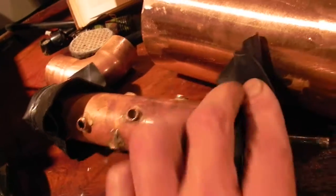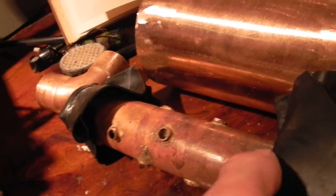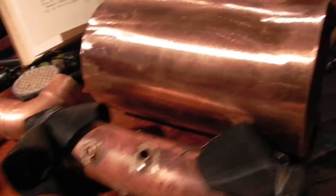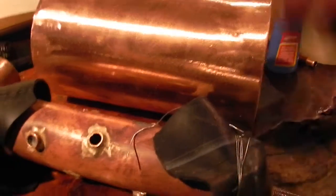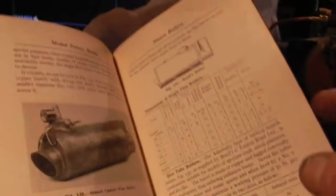I checked for bubbles around my silver-soldered joints. This is 55 easy flow, so it's quite strong and quite hard to braze on there. But I got it all done, checked it for leaks, had to go back and fix a couple of pinholes. Now we'll take it to the welding shop on Monday and we'll put ends on it after we drill the huge hole for this flue.